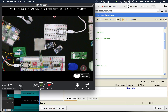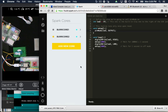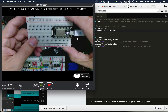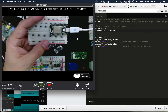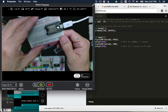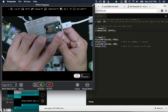They also have a web-based IDE environment. This one is for blinking the LED. I'm going to make sure that specific core is selected — that's core two, what the little star represents. I'll hit the flash button here. You can see it's blinking rapidly — that basically means it's getting its over-the-air flash update. Right from the web-based IDE, there's no dragging and dropping. You just issue the command across the internet through the cloud, and now you can see this little LED here is blinking away based on that change I just made.